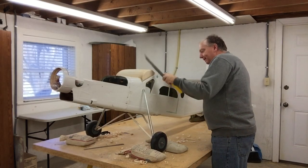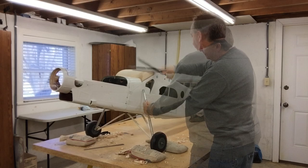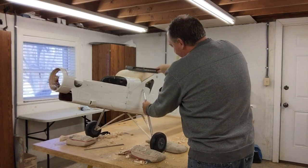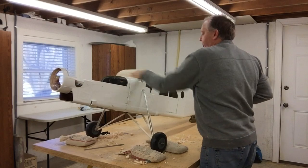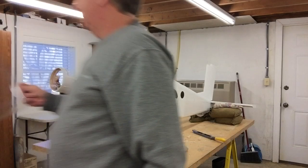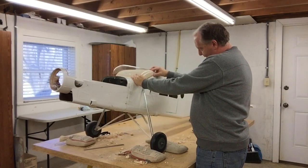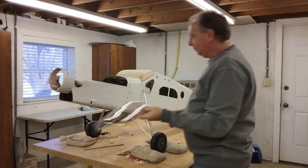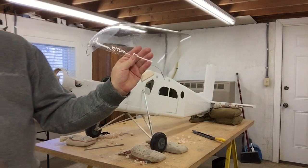We're looking at the fuselage too — I know there's a little point right here. I just want to roughly take it down to the edge and that's it. This rasp takes a lot of material fast, so you kind of have to eyeball it. Looking at our shape — and I have something you normally don't have — I have the original windshield, so we can always put it over there to kind of see where we're at and what kind of shape this needs to be.